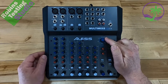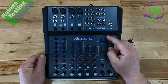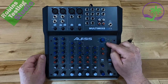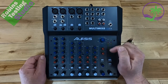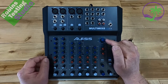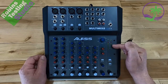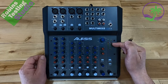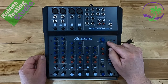The built-in effects are really nice — levels are controlled by the red knobs, and you choose your effect from a selector dial. You start with bypass, then have options like hall, delay, chorus, and more going around. The built-in LED meter runs from minus 24 dB up to unity in green, then plus 6 dB in yellow, and clipping at the top. It also indicates power and phantom power status.